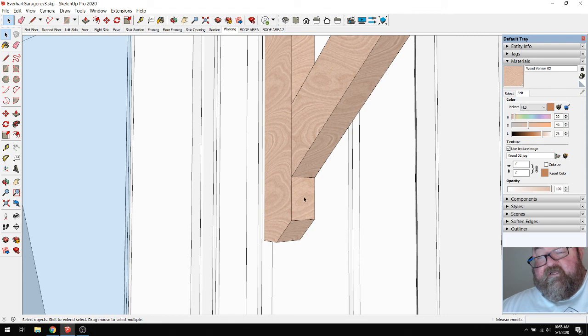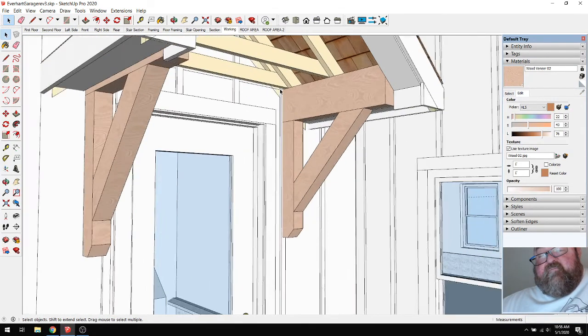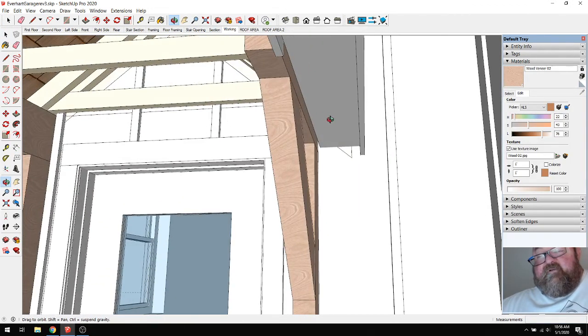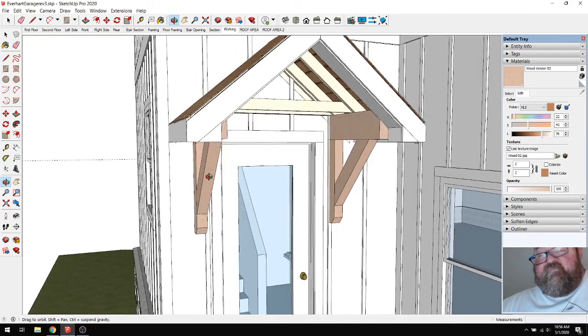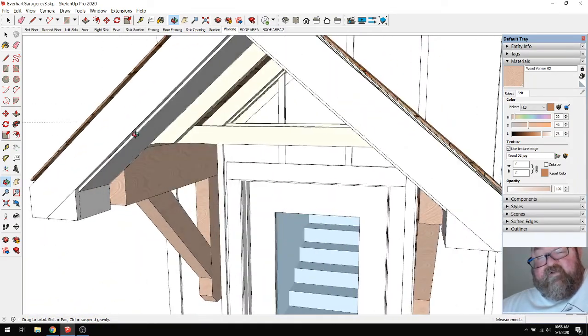of that little rectangle. I'd run a lag bolt here and then one up here somewhere where it's easy to get to. And we'd probably have some brackets bracketing this thing where it was hidden, like up here behind the soffit. There would be a bracket also holding this. Some of those would never move. But this gable end would be closed in.